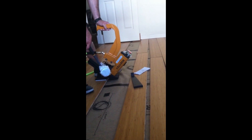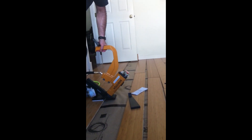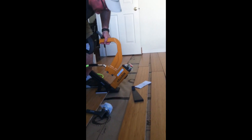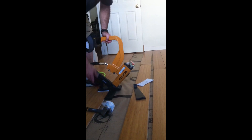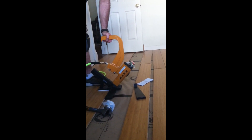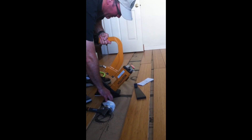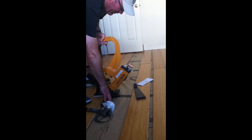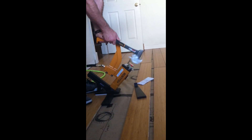And you're doing every eight inches? Roughly. The block I have is essentially six and a half, almost seven inches. The nailer drives it in center of this, so if I add this and this together, between here and there I'm roughly at about eight. So from where my last nail was, I can do this and I'm roughly at about eight inches. I'm not really doing it every eight — I wish I was that precise, but I'm just not.